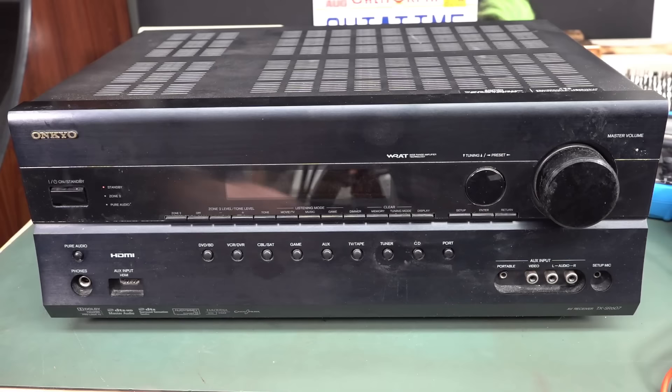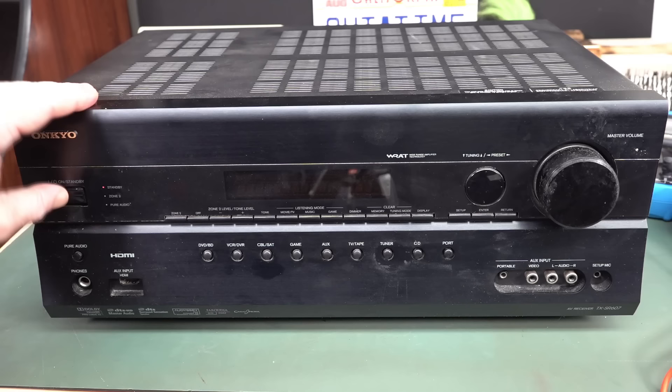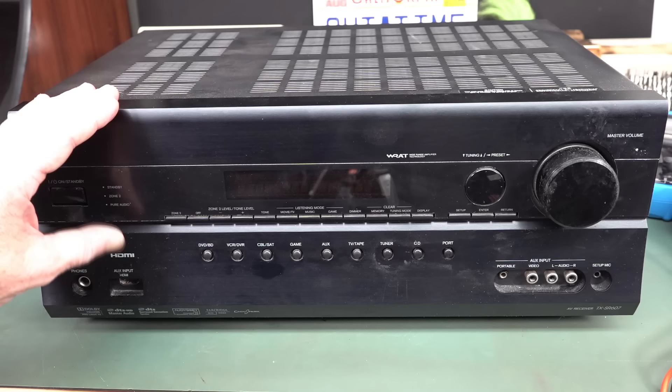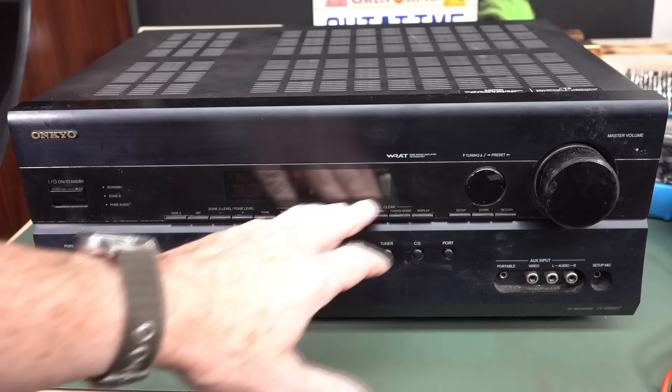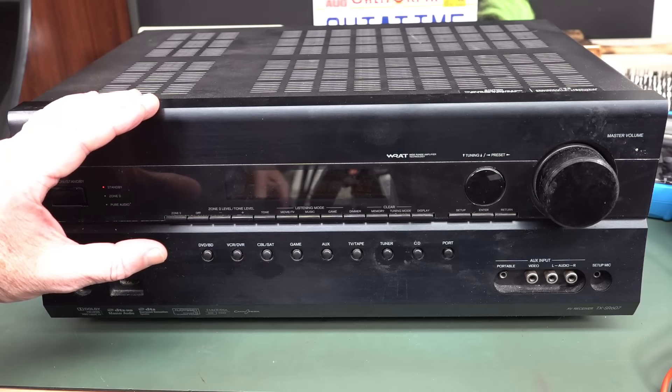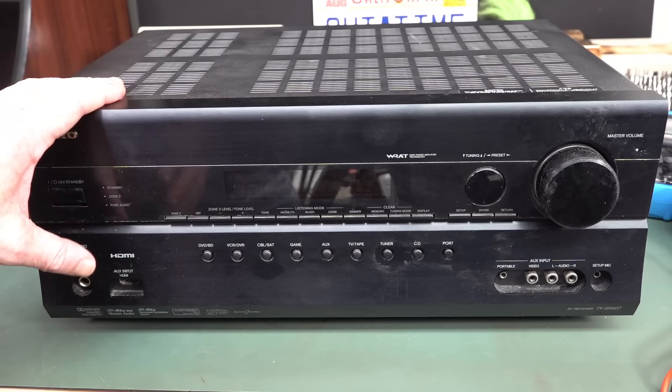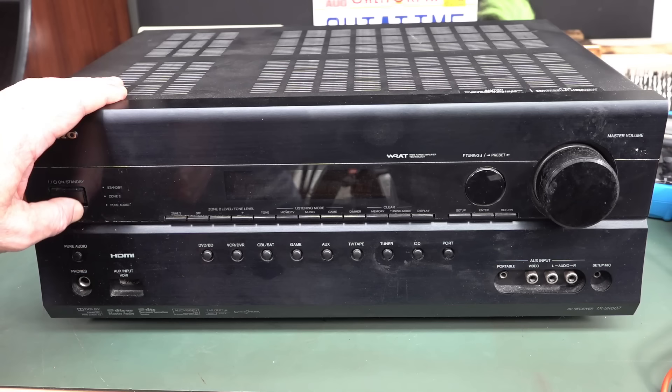You might be able to see the little standby LED there — it's on, and that's supposed to be on. It just relays a click in. It's gone out of standby, some relays click internally, but there's nothing on the display at all. It's one of those vacuum fluorescent jobbies, but I can't see anything. Then you press the power button again and the little tiny standby LED comes on. I don't know if we've got a display failure. Given that it does seem to come out of standby, I could physically feel the transformer inside — big-ass transformer — vibrate. So you can feel the magnetizing current.